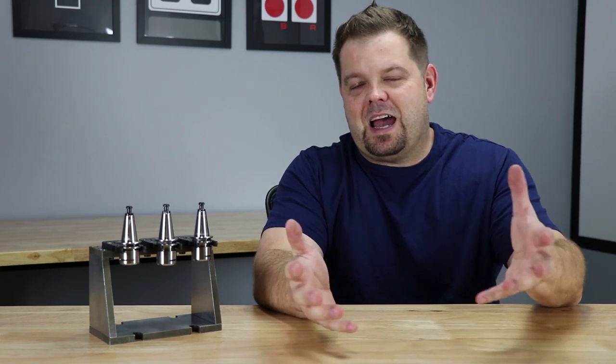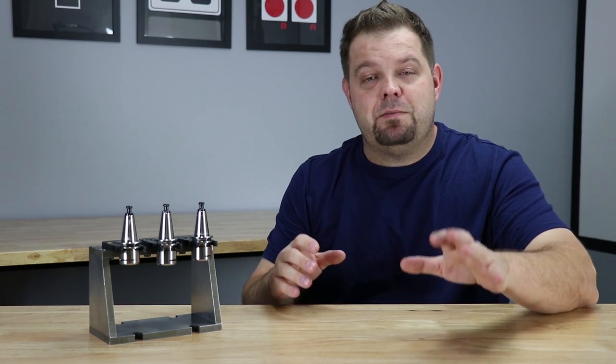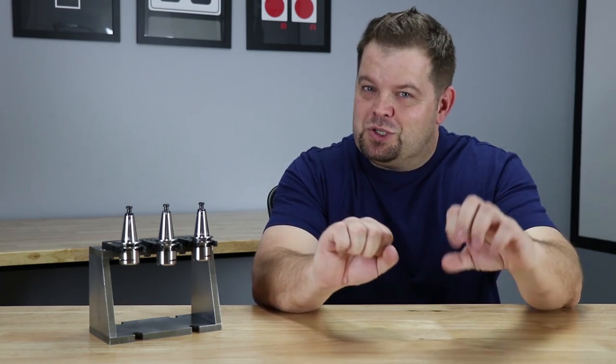All in all the quality of the machine is pretty decent — it's not high end. By the way, I'm not sponsored by Sile; I'm just trying to share my story. One of my biggest complaints with the first machine I ever bought was that its backlash was just out of control. It's hard to cut something accurately when you have backlash. Old-time machinists on manual machines always took conventional cuts — you jog the machine into position with the DROs, lock down the gibs, then take your cut. The reason you take a conventional cut on an old machine is because you're working against the backlash, creating continuous pressure.